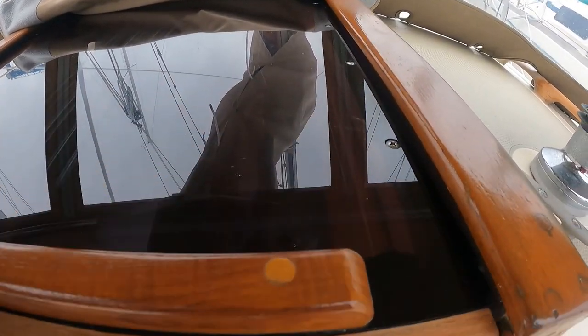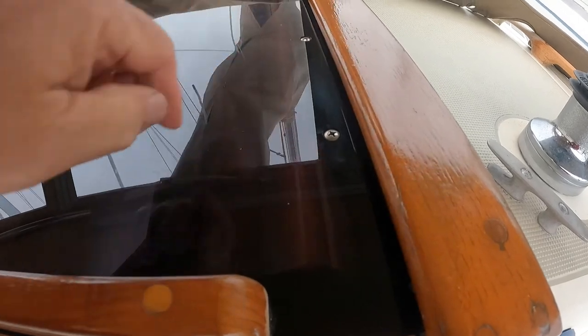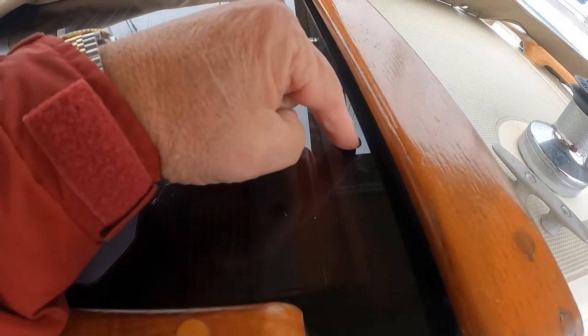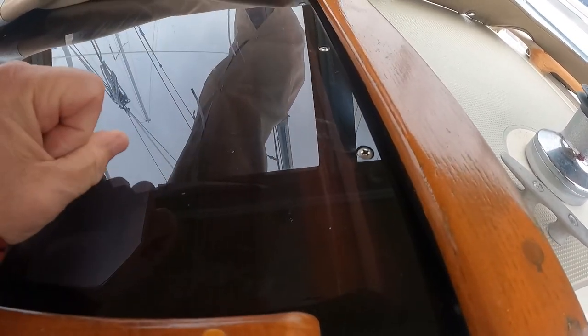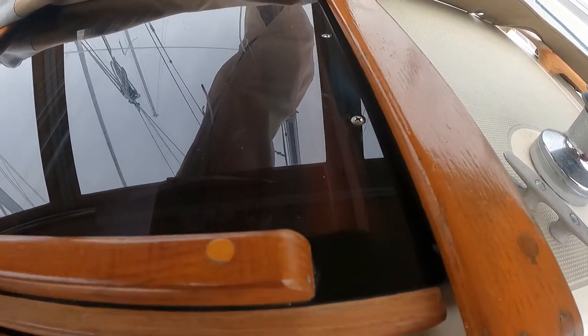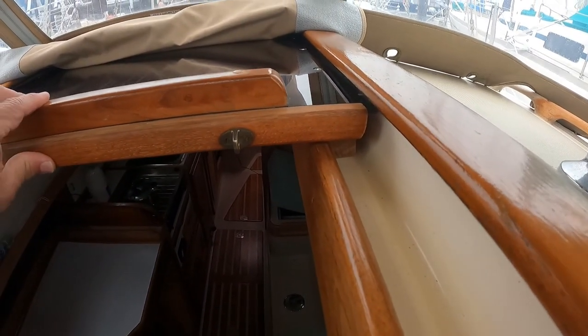After building a teak frame for the acrylic to sit on top of, we then laid down butyl tape on the edges and then put the acrylic down on top of the butyl tape, running our fasteners through the oversized and countersunk screw holes. It makes for a very, very solid hatch. This particular acrylic that we are using is 1/2 inch thick.